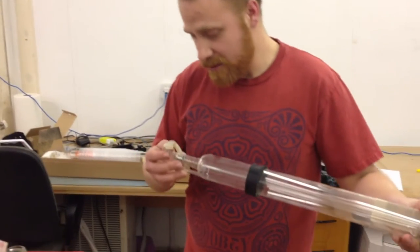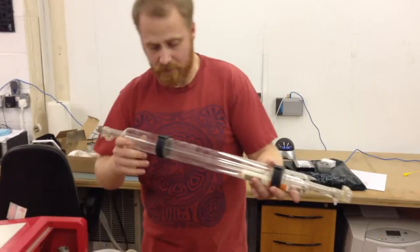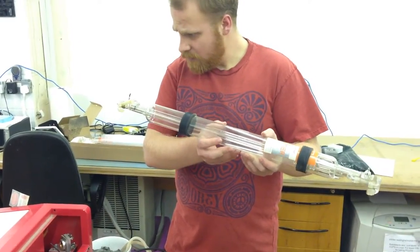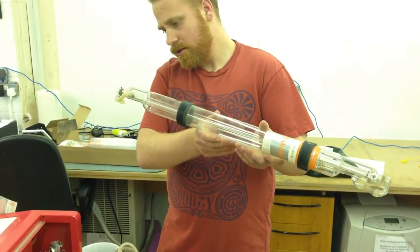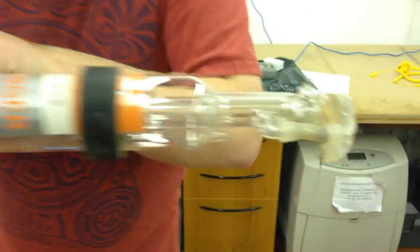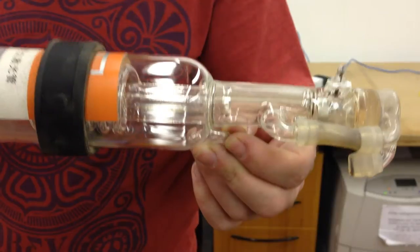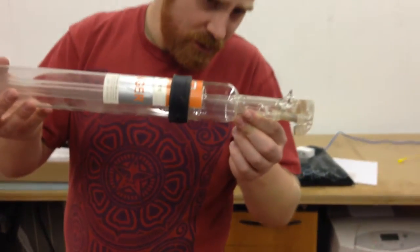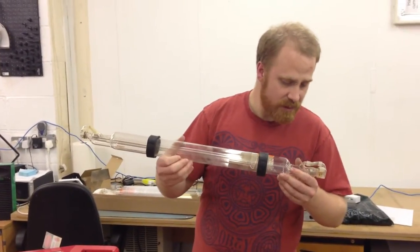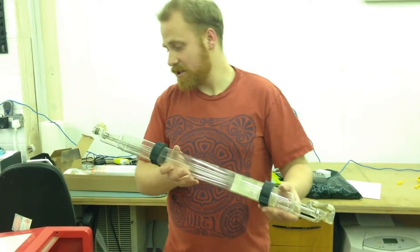Interesting, I've never actually seen one of these before in such detail. There's an outer jacket. Output coupler. High-reflective mirror. You can see the little round electrodes in there. Right down the middle you can see where the discharge goes. On the outside of that is a water-cooling jacket. And around the outside of all of it is some sort of envelope — I guess that's a gas envelope or something. There's no Brewster window, so the light coming out of here is not polarized. And you can see the water-cooling circuits — it's just a nice piece of glassblowing.